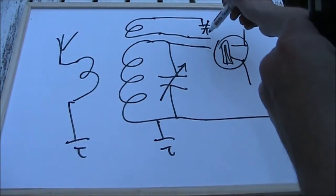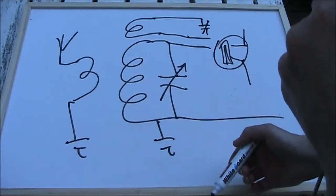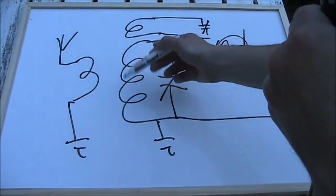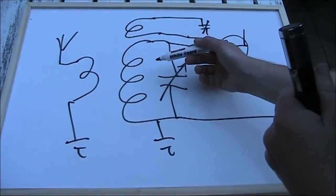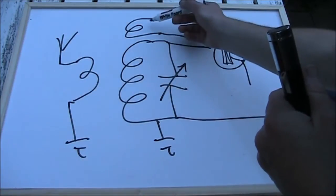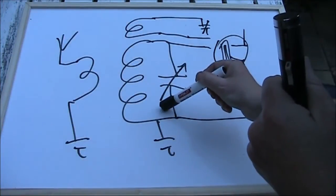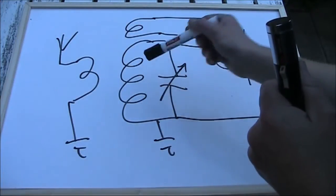Although sometimes there may be a variable resistor here. And finally, the antenna coupling coil. If you want to cover a higher frequency, the easiest way is to remove some turns off the main tuning coil. You should also remove a proportional number of turns from the tickler coil and the antenna coupling coil. With that arrangement, you'll lose coverage at the bottom end of your original tuning range and gain frequencies higher up.